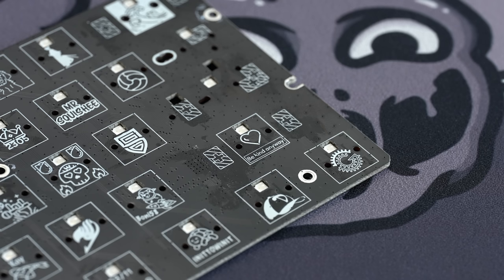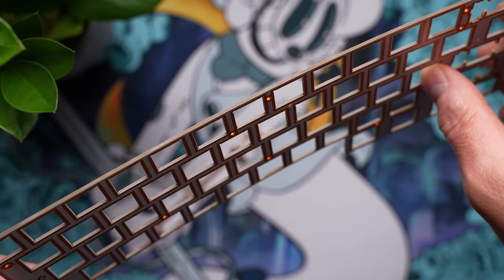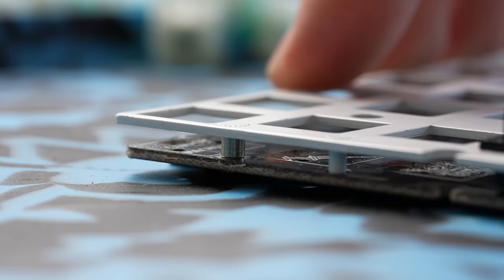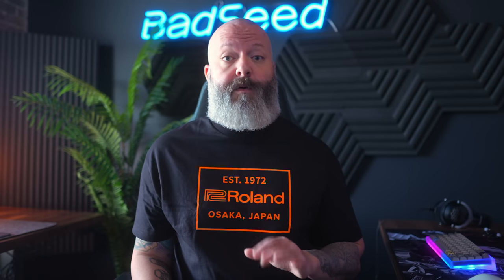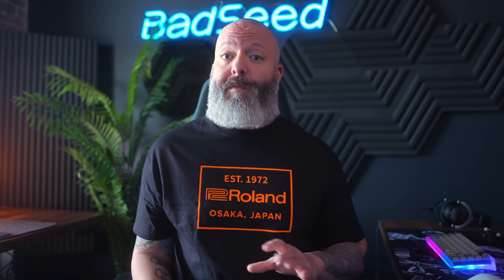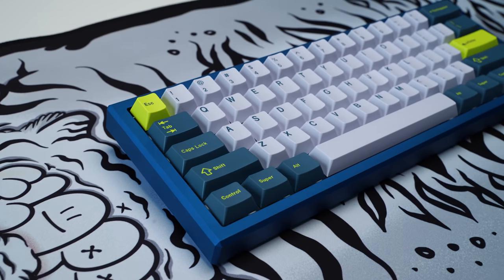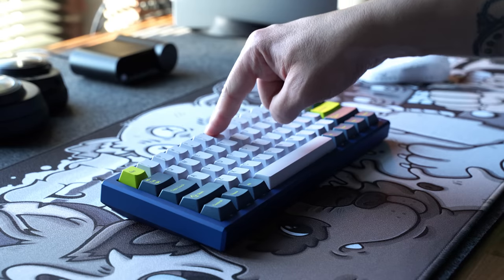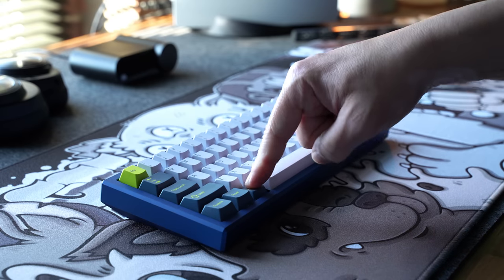Only the fixing pins make contact with the PCB, which isn't enough to keep the assembly together — it's the PCB that screws directly into the case, not the plate. The holes on the PCB don't match up with the holes on the Epomaker plate. I'm not saying a plate swap is impossible — you'd just have to cross into full custom work, have a plate fabricated, and even then no telling if FR4 will be rigid enough given how exact the tolerances have to be. Wooting saw community comments about making the keyboard module available with different plate options and PCB mount stabilizers — it's not off the table, they're considering it. The Salvation case also isn't ideal here since the leaf springs make it tougher to sound dampen than the Tofu, and it still sounds much worse than the Tofu even with the tape mod.